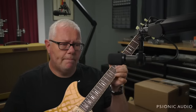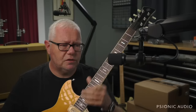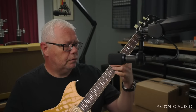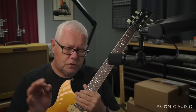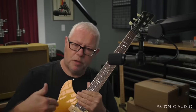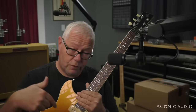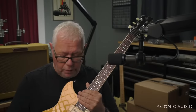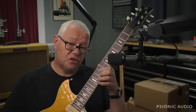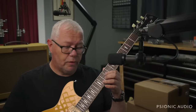Number two. Just a little softer. Middle. With a little trick to make it sound like the middle position of a Gibson, or like Chris Buck's middle position, where you have two volume pots in parallel, so it's not as bright and strident as the stock number three position.